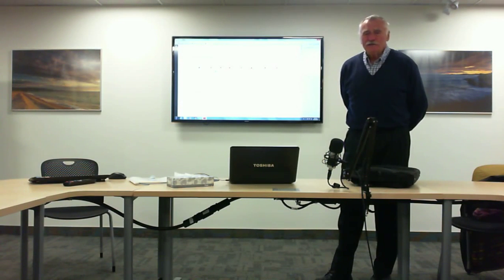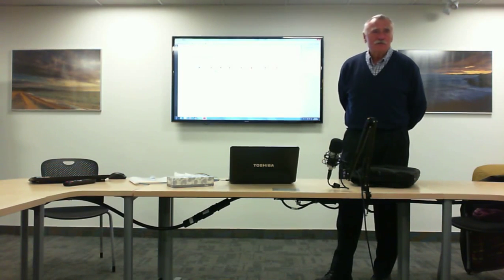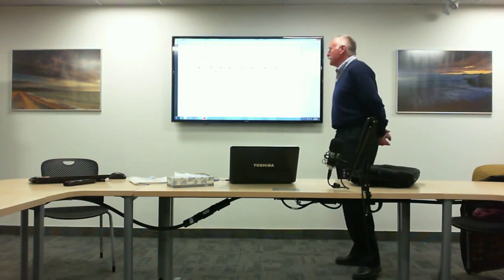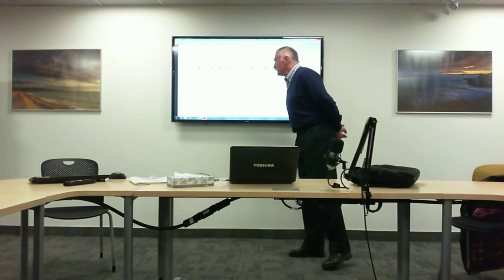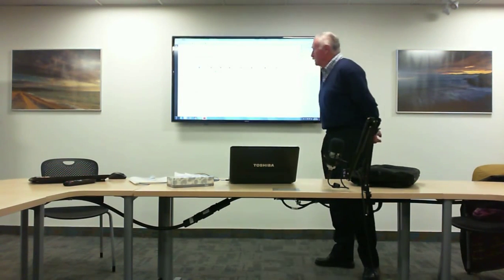Foster and Seeley and ratio detector, they use ferrite cores and coils with a core that you tune with an alignment tool. So therefore those are mechanical components and they are more expensive nowadays. So lately we use integrated circuit technology. Quadrature detectors and phase lock loops are integrated circuits. They do not need mechanical components. So the Foster and Seeley and the ratio detector, they are perfectly good working linear discriminators. They are just more expensive to manufacture, and they turn to integrated circuits.